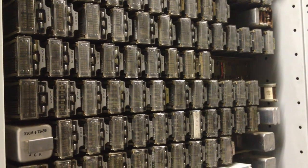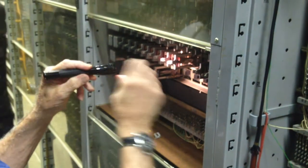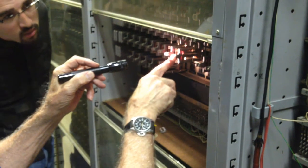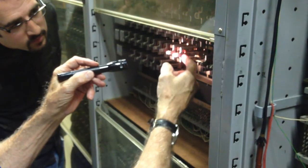You can see how they change these things over the years. The armature travel is adjusted by this — you have a threaded stub and a nut to adjust the amount of travel.